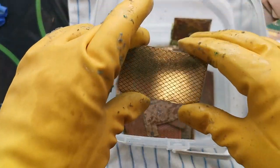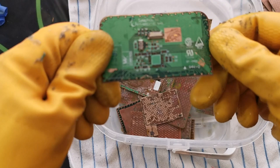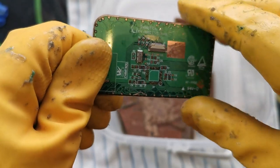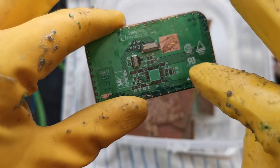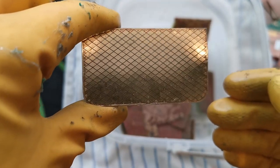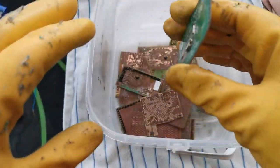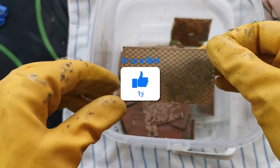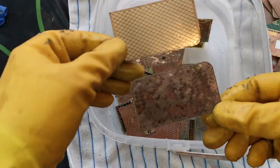This is the one I really wanted to show you — the one with the green solder mask. As you can see, it's perfect — the acid hasn't touched it on that side. On the far side where the green solder mask is, the acid has affected it a bit but hasn't taken much off. This shows what happens if you put a board in without taking off the green solder mask — the acid can't penetrate as quickly, so it takes longer to get underneath.